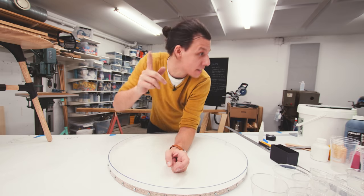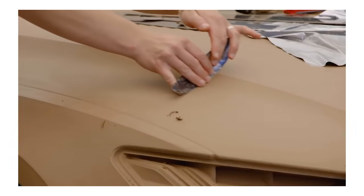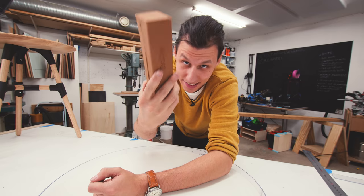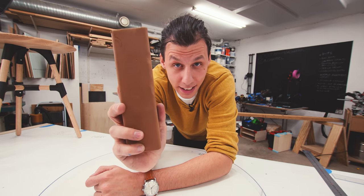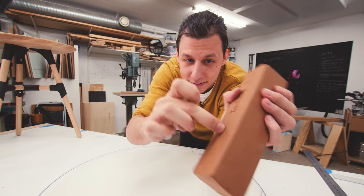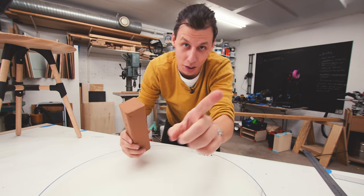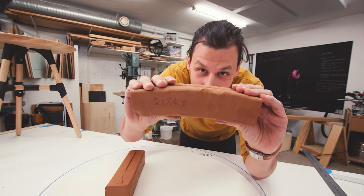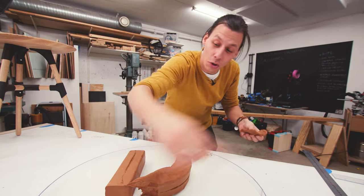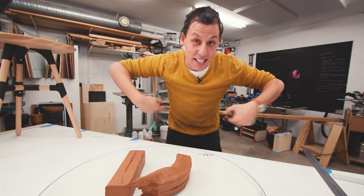The way I think I'll achieve that is with automotive clay. If you've ever seen a documentary about how they design cars — when they make those big full-scale models of cars in a brown clay — that's the stuff. It's actually a form of wax, so at room temperature it's fairly hard, but if you heat it up to 50 degrees it becomes pretty soft and formable. I can use this to form that chamfer all the way around the inside here, and when it cools back down to room temperature I can scrape it and make sure it's nice and smooth.